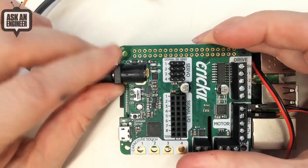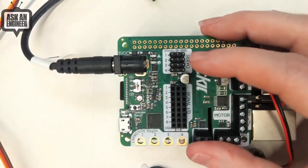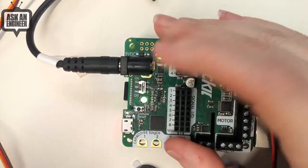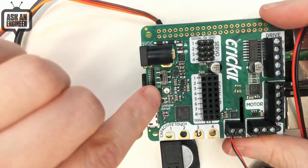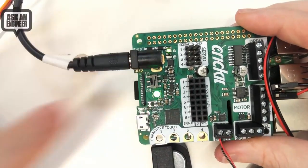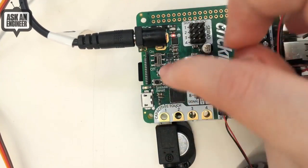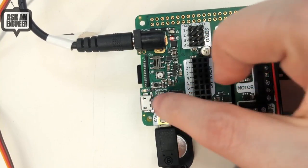Power comes in through here — this is your five volt power. You can also use this to power the Pi, although I recommend having a separate power supply because it's best to have two separate supplies, one for logic and one for motors, since motors can draw quite a lot of current and can be noisy. There's a little LED that tells you if the power is good or bad. If you power it separately and then unplug the power, it turns red to let you know the Crickit hat has lost power. There's also a reset button and a USB port — this is for updating the firmware on the chip, but it's also a USB-to-serial converter so you can log into your Raspberry Pi directly using any serial terminal software.